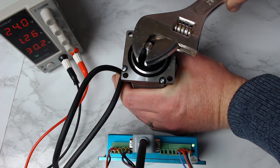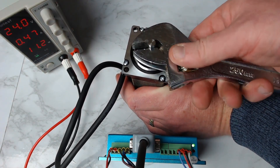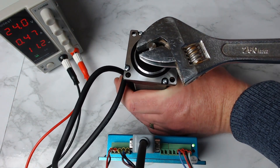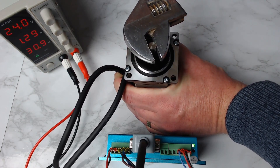The more pressure or resistance applied to the motor, the more amps are increased, and as you can see it's fighting against me to bring it back to that position. If I put too much load on this motor it would alarm. I'll apply at least about a quarter of a turn and you'll notice it cuts power to the motor — the driver will alarm and the motor will stop.